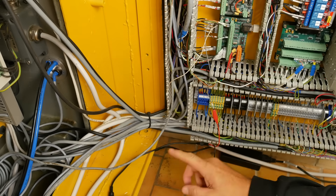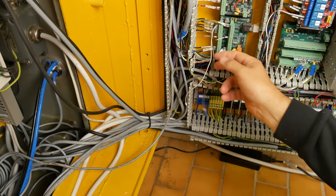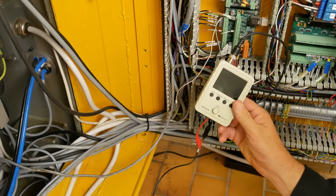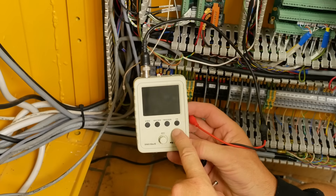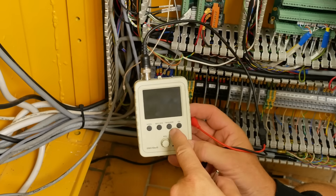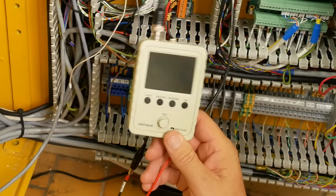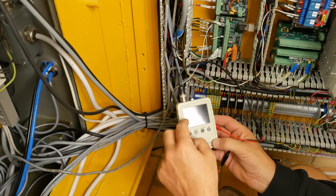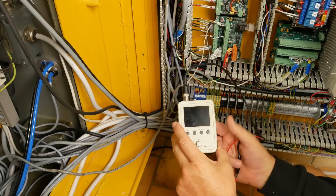Those two end-stop hall sensor wires come into this board on the first two pins. I tried adding flying leads on them and connecting up my toy oscilloscope to ground, but I don't know whether the oscilloscope's lacking bandwidth and sample rate, or I'm lacking knowledge of how to use it. Although I watched a bunch of YouTube videos on how to set it up, I wasn't able to get a picture of that voltage spike — it was at 10 microseconds on a 1-volt scale with a trigger set for anything above 2 volts, but I couldn't see anything. I think my battery's gone flat.